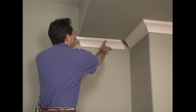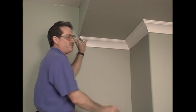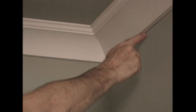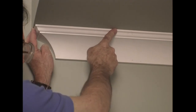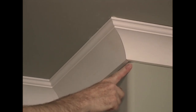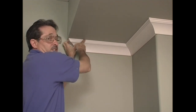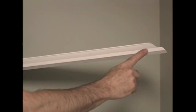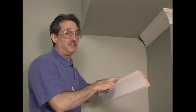Let's look at these two walls here. I arranged this set so that most of the joinery you find in a home is right here. Notice how the crown molding touches the wall down here, at the bottom of the crown, not up here at the ceiling. The same is true at this outside corner — the crown molding touches the wall at the bottom. That means I have to measure from the crown molding down here, not up against the ceiling. So my measurement marks are always on the bottom of the crown molding, not on the top — at least almost always.